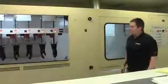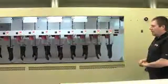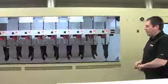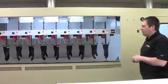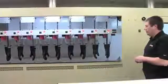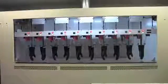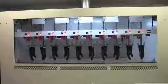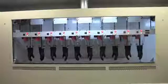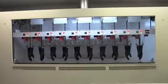The first part of the process is the gloves will be filled internally with water. Once the gloves have been filled to the proper level, they'll be lowered into the test bath and a protective door and window will come up in front of the gloves being tested. The gloves have all been filled to the proper level and will lower into the test bath.